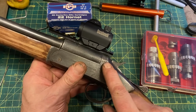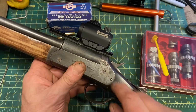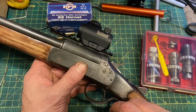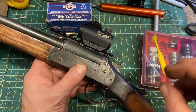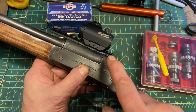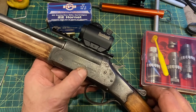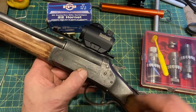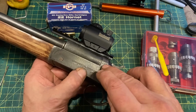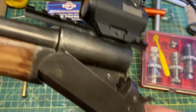I used a 3/16 inch cobalt drill bit, drilled the hole out to 3/16 of an inch, and then I took another chromium cobalt drill bit that had kind of gone to shit and cut off the shaft and used that as the pin. Nothing's going to defeat that pin. And I enlarged the bottom of the firing pin, where it engages over the pin, so that it would continue to function. And function it does.